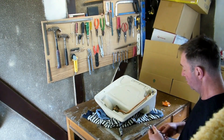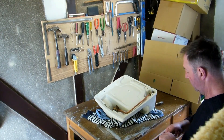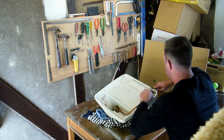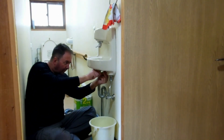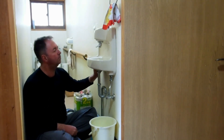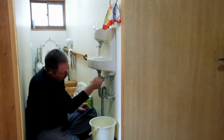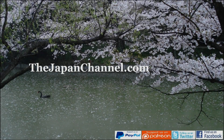Obviously when it was brand new it was adequate, but as it's got older that rubber grommet's probably a bit dried out and the fitting was a bit corroded inside - well, not corroded, just not clean. So cleaning it up. Didn't happen to have a grommet the same size, but it seemed okay once it was cleaned up. Clean up the inside of the pipe too. That lock job we had recently was one win after another - this was sort of the opposite, but it didn't go too badly. Back on the wall again - it just had two big hooks at the top to hold it and two long screws at the bottom. There was a little tiny grommet-y water filter that went at the bottom - almost forgot it. Turned it on. It's not leaking. Happy days. We now have three places to wash our hands.